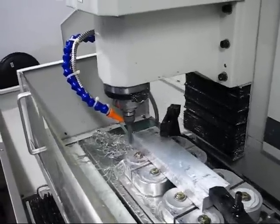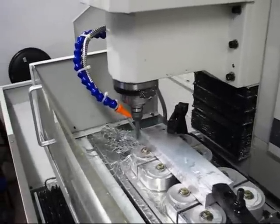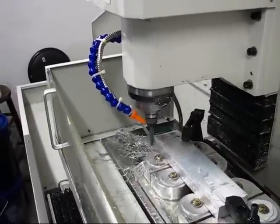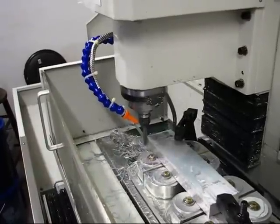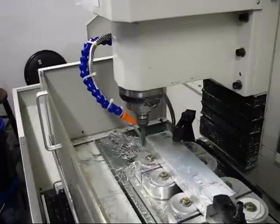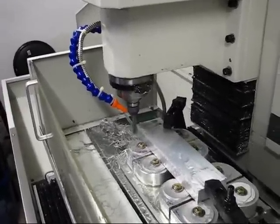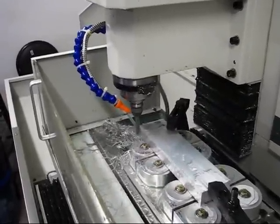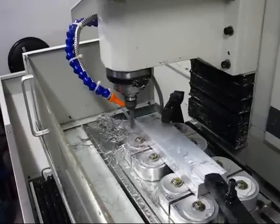It should be mentioned that I am getting significant cutter deflection in these passes. I backed the tool off in the X direction 5 thousandths, and the cutter is still engaging as it comes back to its original position. So I'm getting more than 5 thousandths of cutter deflection over probably the bottom one-third of the material. This material is one and a quarter inches thick and I'm using a full depth of cut — something I didn't mention at the beginning. The good news is if there's chatter on this operation, it will be for half as long.